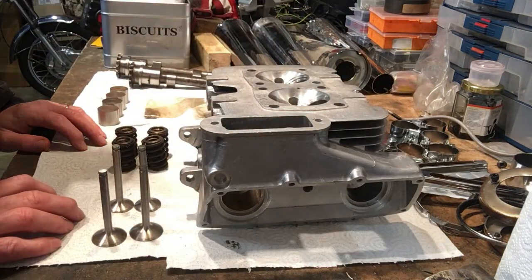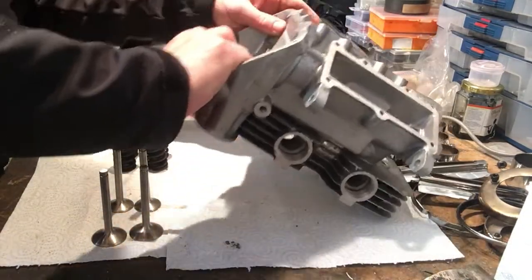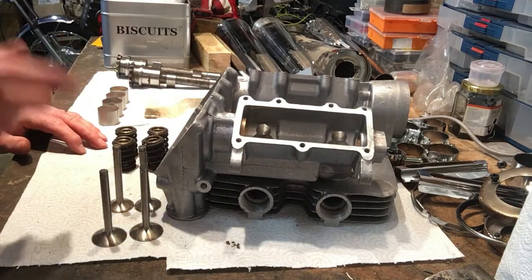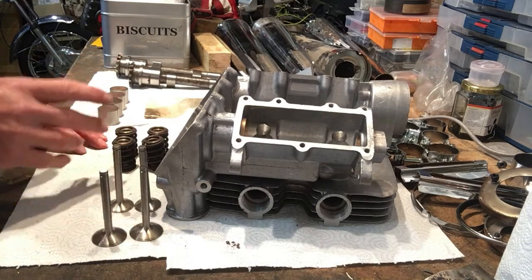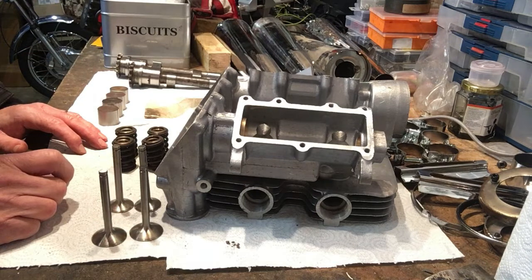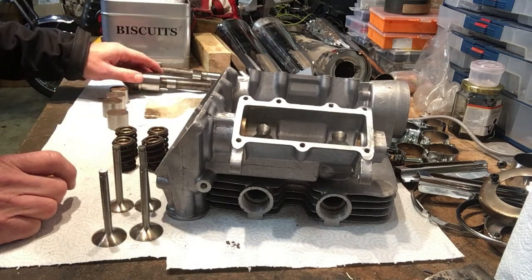So we might call this cylinder head part one, but part two will probably be initially grinding in the valves and fitting the valves. But it's just going to be a test fit initially, because at the moment, with respect to the new valve seats, they're only being cut to a certain extent, and with the fitting of the valve springs and tappet buckets, we've then got to determine what clearance we've got between the top of the tappet buckets and the cam lobes,